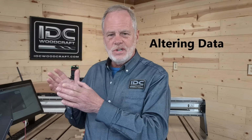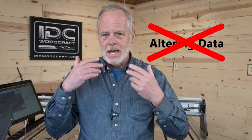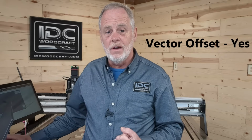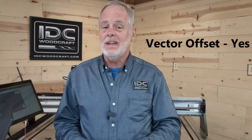So what is my preferred method? Well, I really don't like the idea of changing the router bit data. As nice as it sounds, it's not something I want to mess with because I'm messing with real data and the real size of the tool. My favorite and preferred method is doing the vector offset and creating layers. It's what I've been doing for years, and that's the way I like to keep it. And it's a good habit because I like to keep my designs organized.